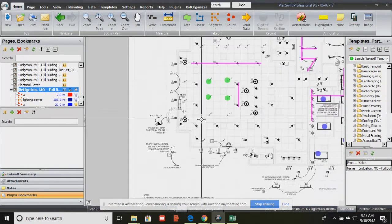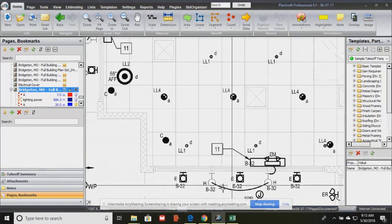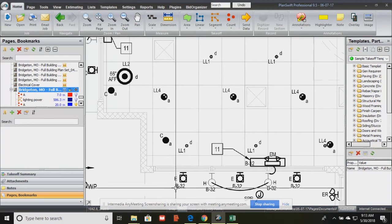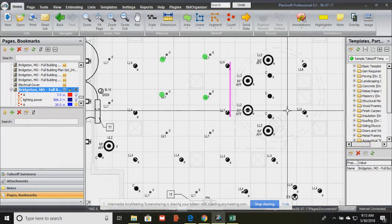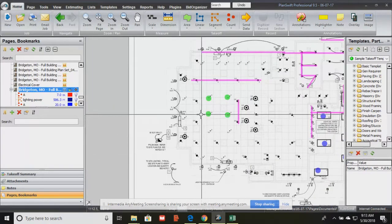One of the two plans you'll find in the electrical set tells the electrician where the lights are physically located, and also how they are powered up. What are they connected to? Are the lights connected through a lighting control, lowercase letter, or are they directly connected to a power panel, which is the panel name, basically, uppercase, and the position on the panel? And we know that fixtures that are connected directly or connected to the same lighting control, when we talk about the conduit, they're all connected together too, and at some point we're going to take that end and connect it to the lighting control panel itself.